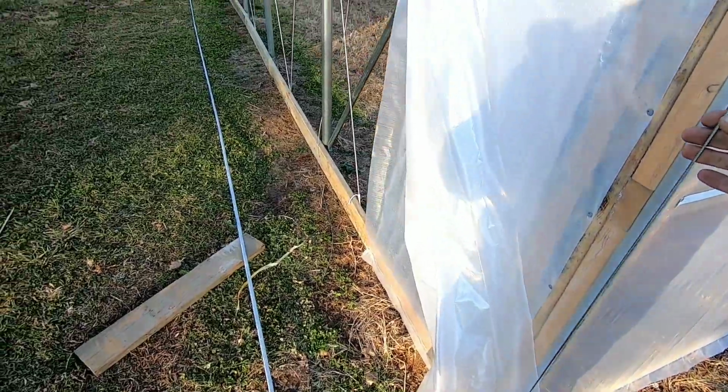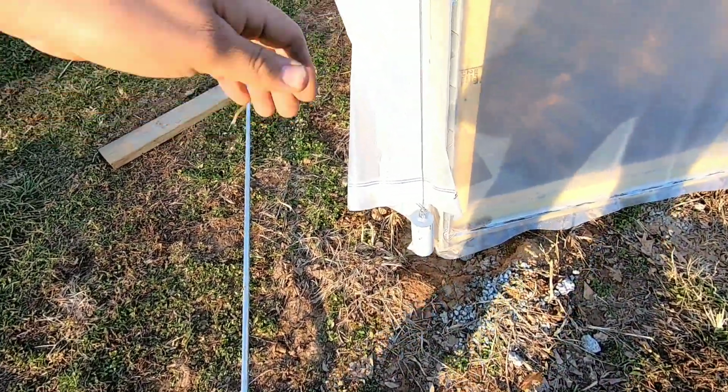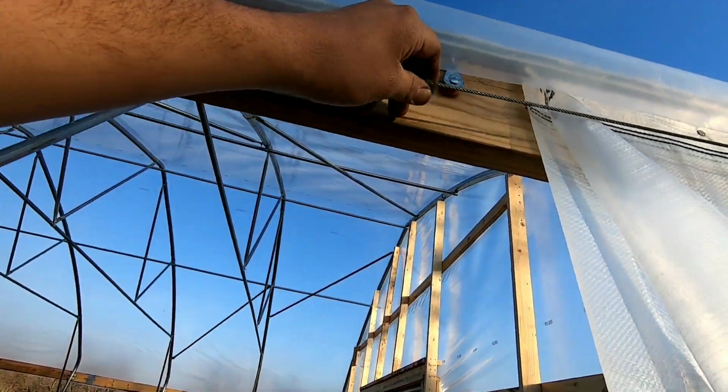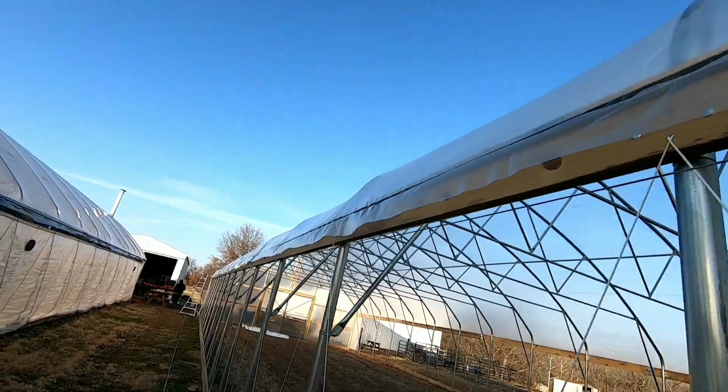So Val is winching it up, and as you can see here, it's good right there. A little more, one more, perfect. And the winch, the weight is dangling there in the air, the cable is nice and tight, and now we're going to get those stake-ons and put them at every single pulley there, and then come back through with the crimper and crimp them on the cable.